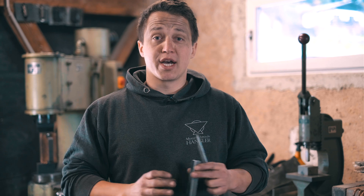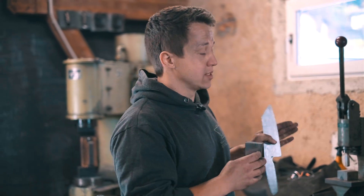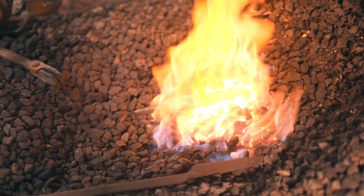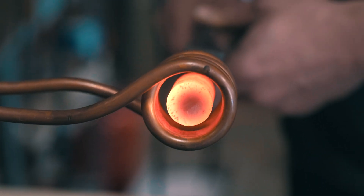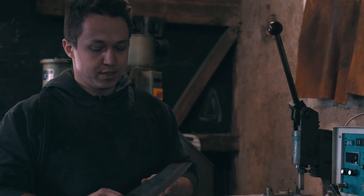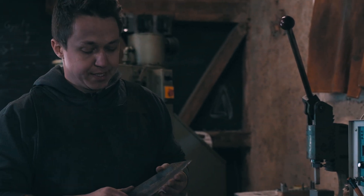There's more to it than just hardening. We're also going to do the normalizing cycle, some grain refining, and the DET anneal — only using the induction heater, which I think is pretty cool. Because this has no emissions, it's affordable, and so even if you're forging in a basement where gas is not an option and coal is not an option, with an induction heater you can make it happen. There's minimum noise, no emissions, no gas, and no risk of suffocating from carbon monoxide poisoning.